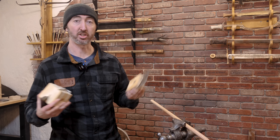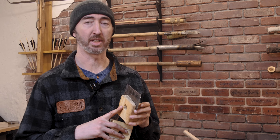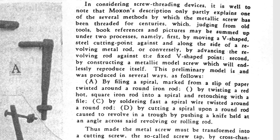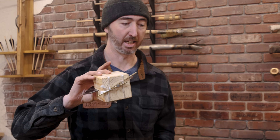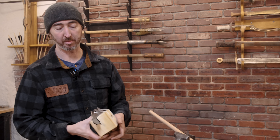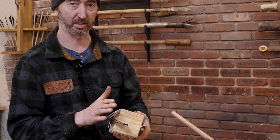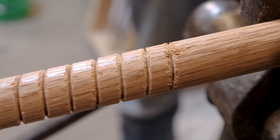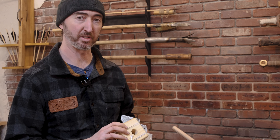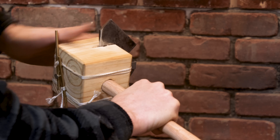In the process of making the DaVinci thread-making machine, we came up with a simple tool used to basically mark threading on wooden dowels. Some comments pointed out we could essentially just use a tool like this to cut our own threads, so I iterated on that and made a better version. I made a thicker cutting blade cut into a sawtooth-type design, and used a simple tensioner setup to hold the blade on end. I don't know if you can hear that, but it does sound a lot more aggressive than the original tool, which is a good sign.